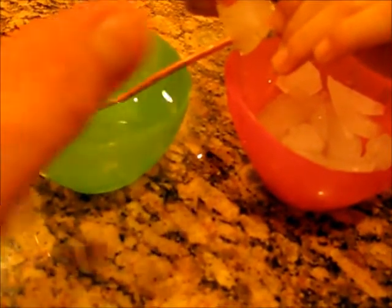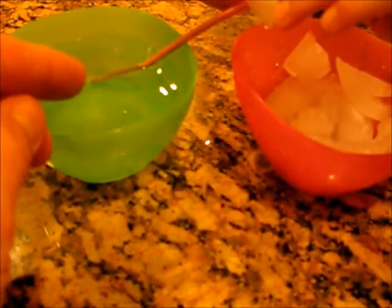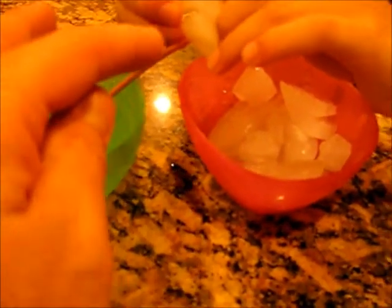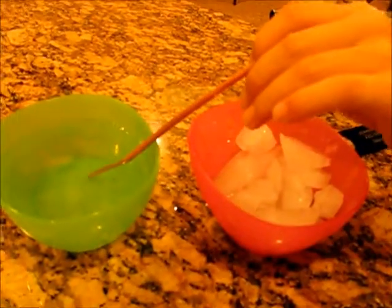The way this works is this is actually a hollow tube where the inner wall is a wick material, and there's some sort of fluid in the wick. It gets vaporized on the hot end, and it flows to here and recondenses. It's actually literally a pump. It's getting this little effect here.